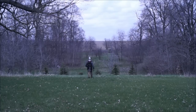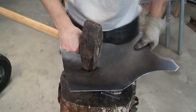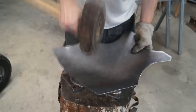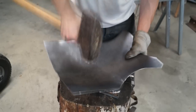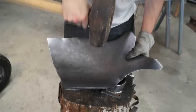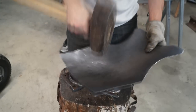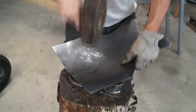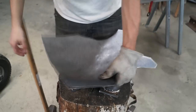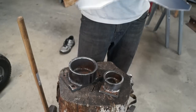So with the research mostly over, I started making the thing, and unfortunately I don't really have a process for making the breastplate piece. But there's nothing fancy about the breastplate, since it's a relatively shallow shape, and since I'm a small guy, I was able to dish the whole thing without any application of heat or welding. In complete honesty, I'm a little concerned about the thickness due to the dishing process rather than raising it, but I think it's negligible since it's a pretty small piece considering just how tiny my rib cage is.